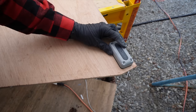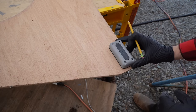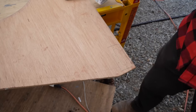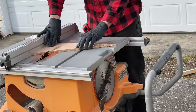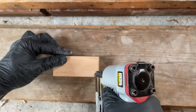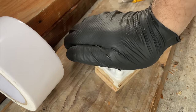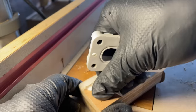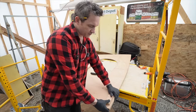I want it to be quite close to the top, so it would be difficult to drill these holes later. We won't go right to the edge, we'll just go close. As I often like to do, I've decided to make a drill template for this fitting. I've found that when trying to plug long holes with epoxy, this makes the work come out the nicest and is probably a time saver in the long run. We'll put this here somewhere and drill all these holes through.